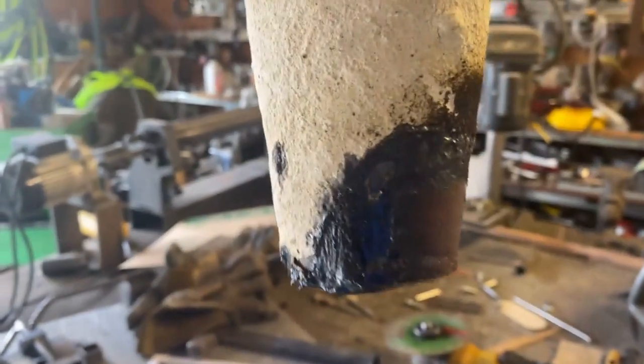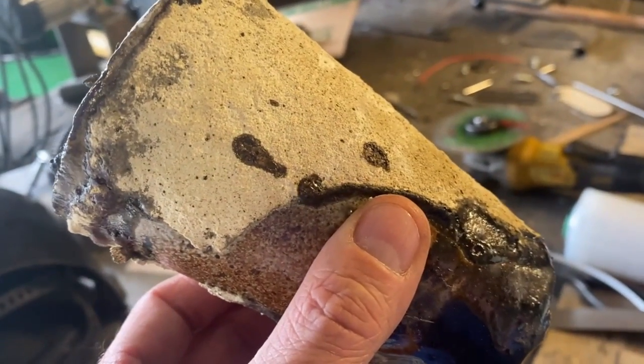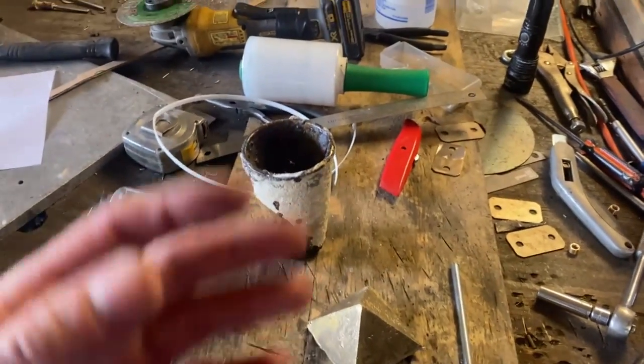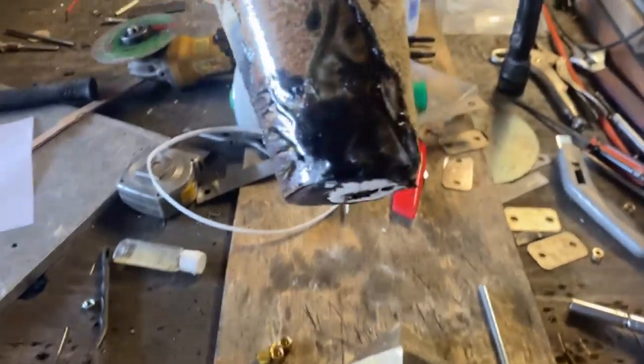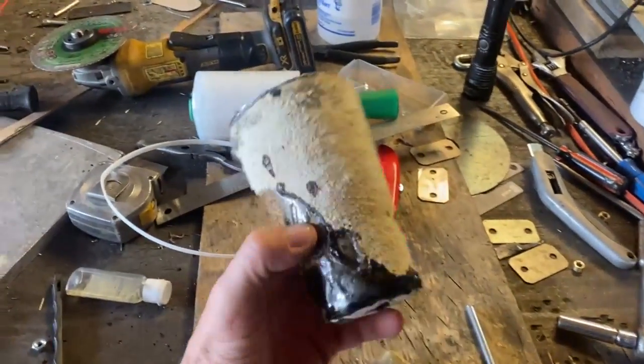I had white-hot pieces of refractory melting out of the side and shooting out at me. Here's a look at some of that crucible heat shield I had made a while back. The problem with it is when it gets hot it turns into an oxide that is very reactive with water, which then turns into another chemical that has 75% more volume — it fluffs up and just falls off into a powder. So it turned out not to be something that can be used very well more than once; it works great on a first application.